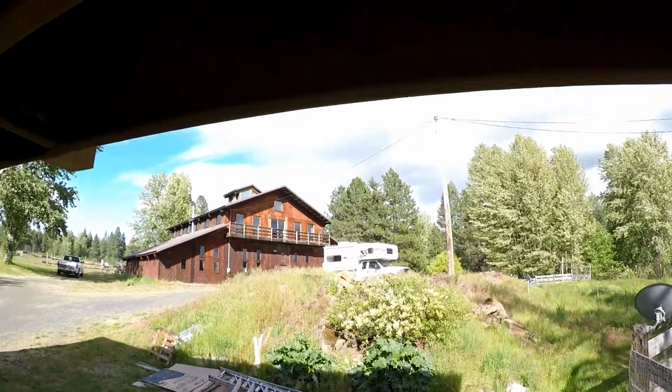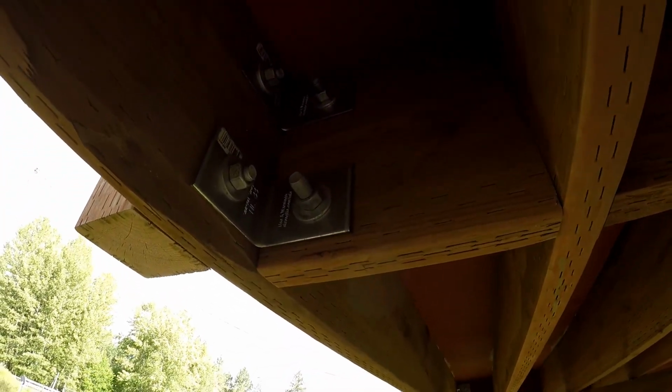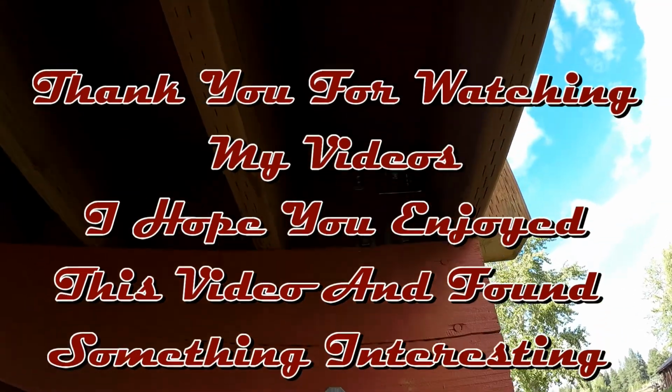Okay, and then over here you see we have a center post up there, and there are the angle brackets that hold that post, and then those go into a piece of blocking, and it makes it a very, very solid post. And same over here. So you put those brackets at corner locations and post locations, and you have a very solid deck.